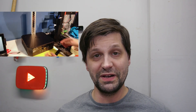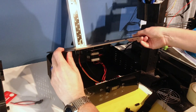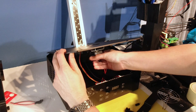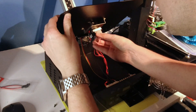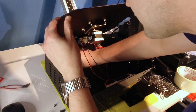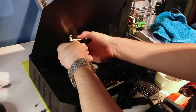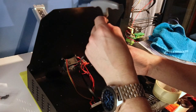After a short break to lower my blood pressure, I came back with a clear head and decided I was going to do a little surgery on this thing. I correctly assumed it would only be about eight to ten screws to get that top deck off and get inside. And once I was in there, I noticed that the stepper motor was mounted to nothing. There are two little screws that are supposed to hold that stepper motor to the bracket, and those two little screws were just chilling in the bottom of the case, all loosey-goosey, just hanging out.